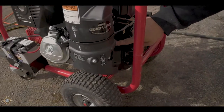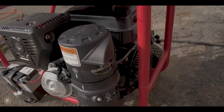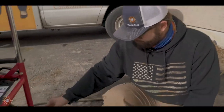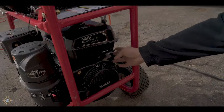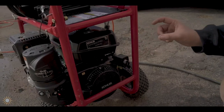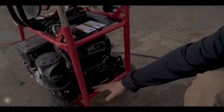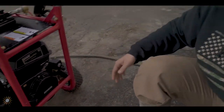To start up, flip the gas on. It's a cold start so we might need to choke it - flip your choke forward. Sometimes when restarting a warm machine you won't need the choke. Next is your throttle - it should be all the way in the off position. Move it up until you hear it click; that click means it's just to the edge of the throttle going forward, and that's your starting position. This machine has two ways to start: a key, which is easier, and a pull cord as backup in case the battery's dead or you've lost the key.